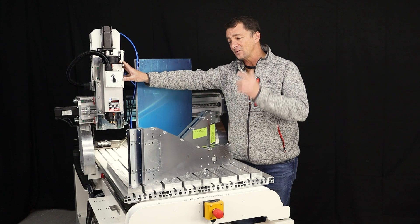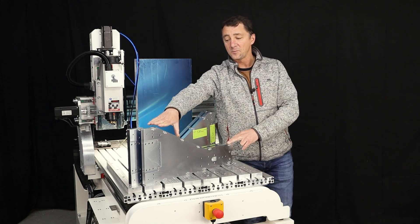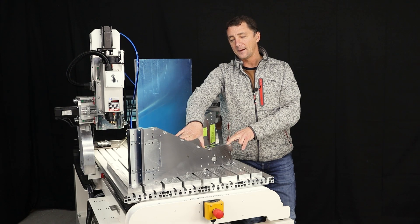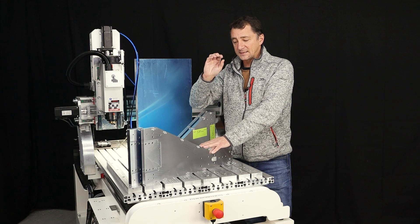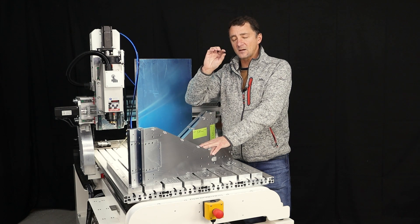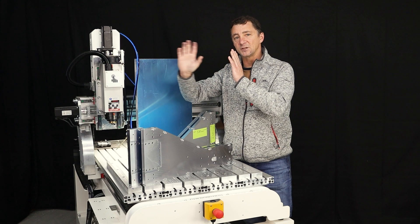The real difference for me was that I would normally do my spring cut with a 0.1 millimeter step-over left on the stock with a 6 millimeter single flute. I found that RPM to work extremely well — the single flute that I'm using just sounds so sweet. There is no chatter, there is no resonance — you can just hear it's just sweet machining.